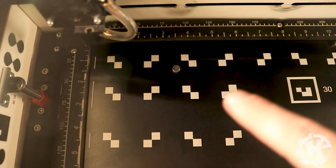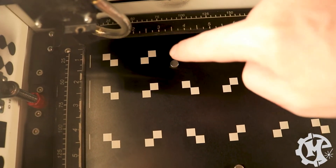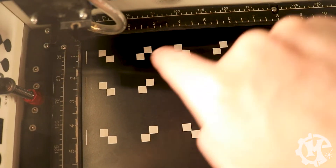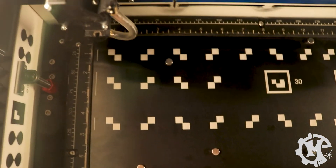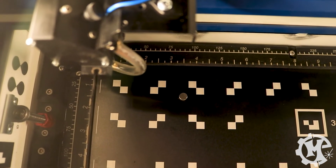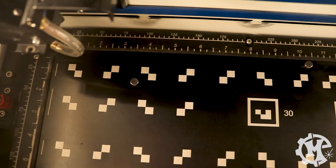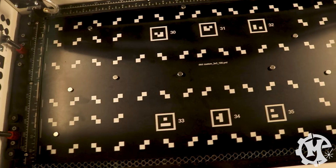Here's the actual pattern. If you look where I placed this magnet it's at about three and a half inches on the X and about an inch and a half on the Y. As I go through here you'll be able to pause the screen and see where you can put magnets. A lot of it depends on where your material is bowing, but I have maybe nine magnets on here right now.